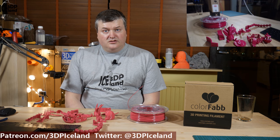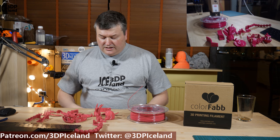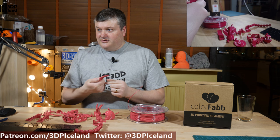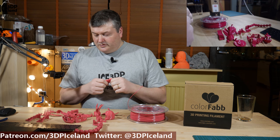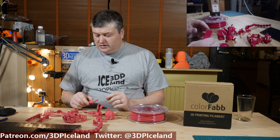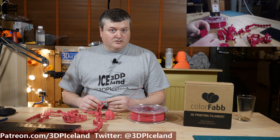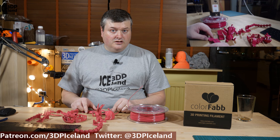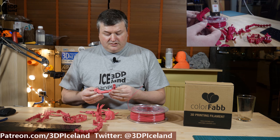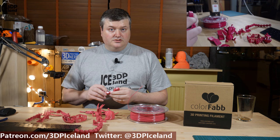So as you could see on the models I printed, print quality is excellent on all parts — both mechanical and organic. Layer adhesion is extremely strong; I was trying to break a thin ring model and was unable to do so with my hands, and I had a very difficult time releasing the base of my Maker coin. Even printing at 270 degrees, bridging and overhang performance is excellent if you have a good part cooling fan. For mechanical parts like this GoPro mount on my MK3 printer, it's an excellent filament, and because of its mechanical properties you can use it in a variety of situations.